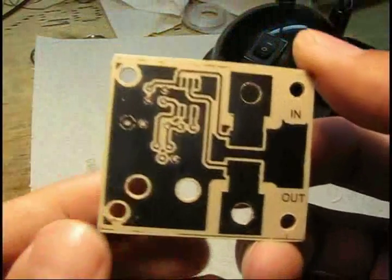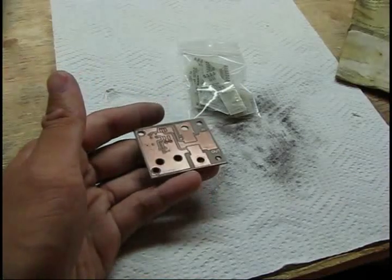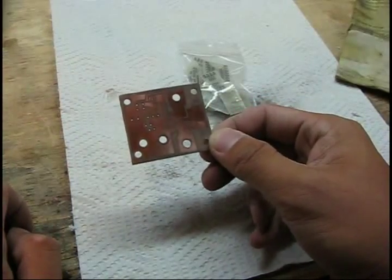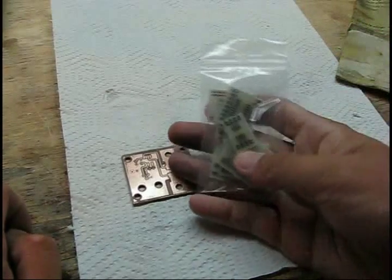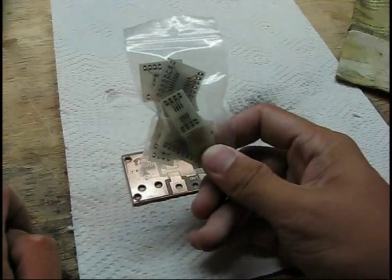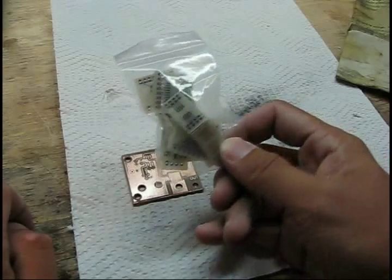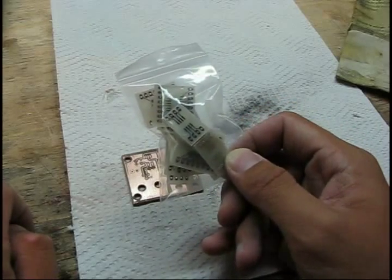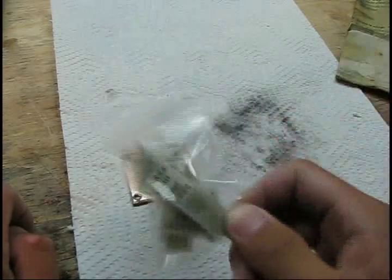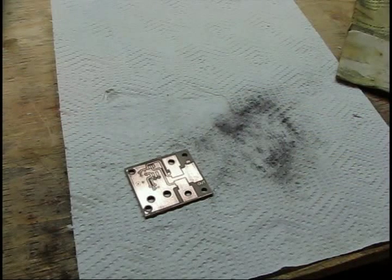There are some advantages and disadvantages which I'll also address in the article. Here's another neat trick: once you have your boards done and start getting better at them, you can make lots of little utility boards and panelize your designs. I've actually made an entire board of SMD adapters. These can be maybe 50 cents to a dollar a piece, but when you get to some of the more unusual designs, not all stores carry them. It's up to your skill how fine you can get your circuit boards, but that board probably only costs about $1 versus $20 worth of SMD adapters.